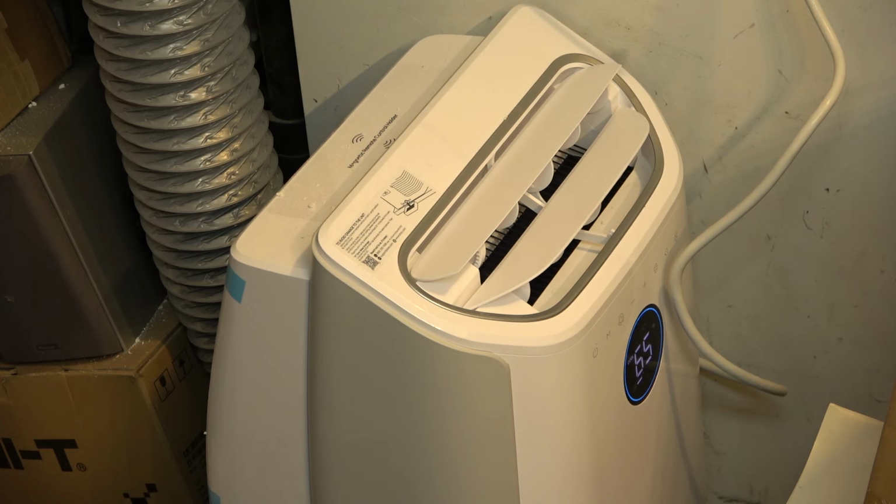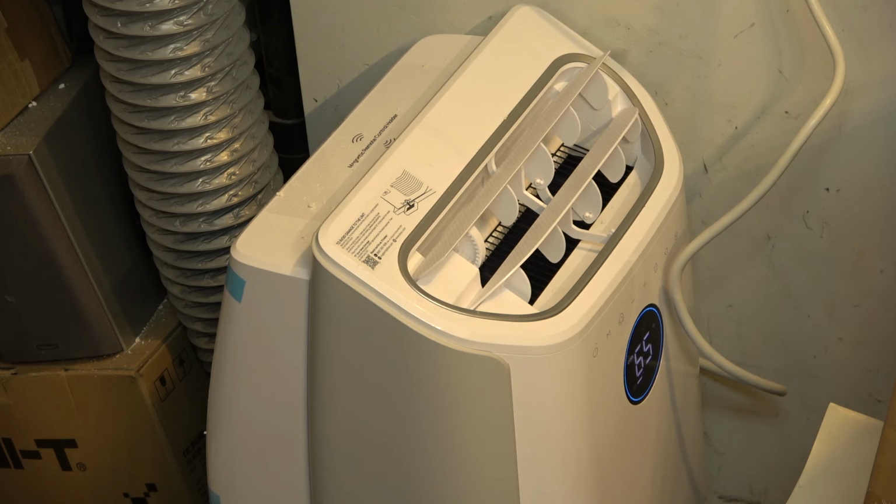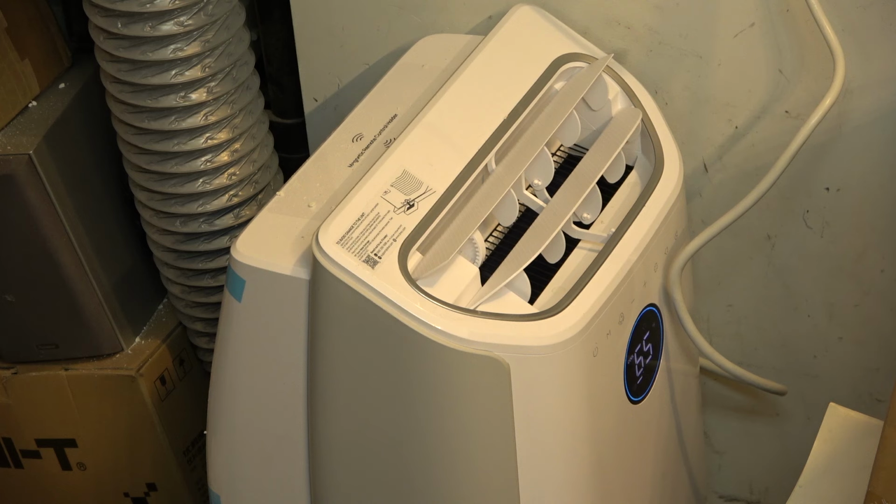So I had two circuits so I could have 220 at a plug if necessary, which I never needed. But I had it wired so that I could wire a plug as a 240 outlet, or two 120s. As I say, a few years ago, around 2011, when I got my car charger, I rewired it because I really didn't need split outlets in the workshop, but now I do. Anyway, let's go wire it up.